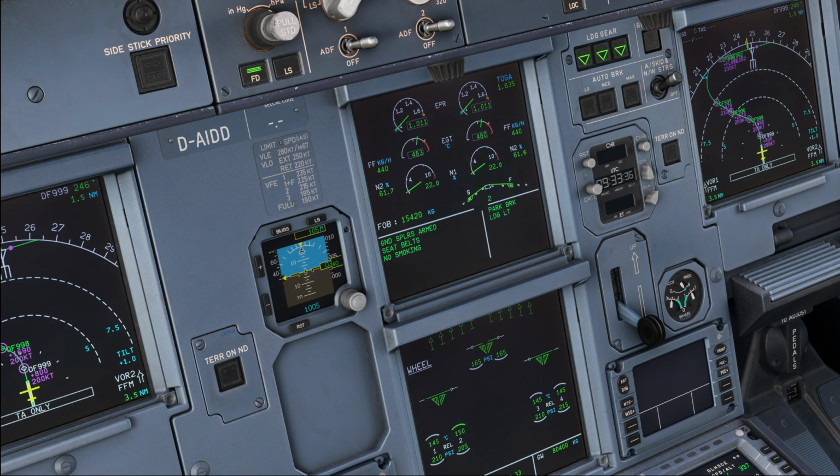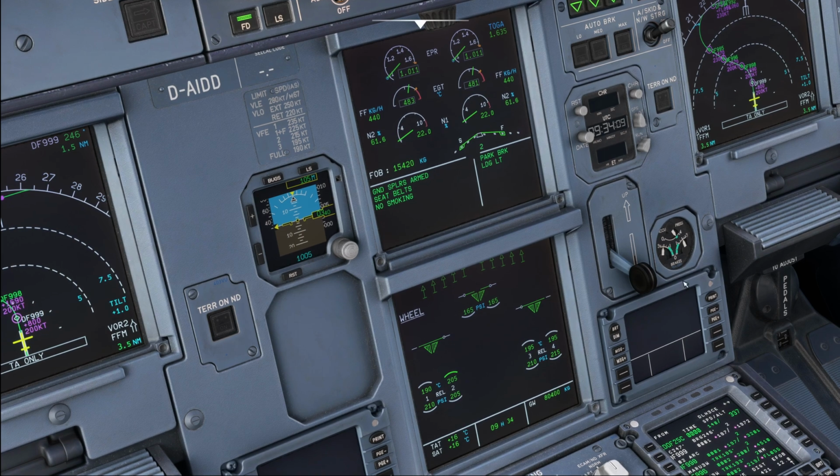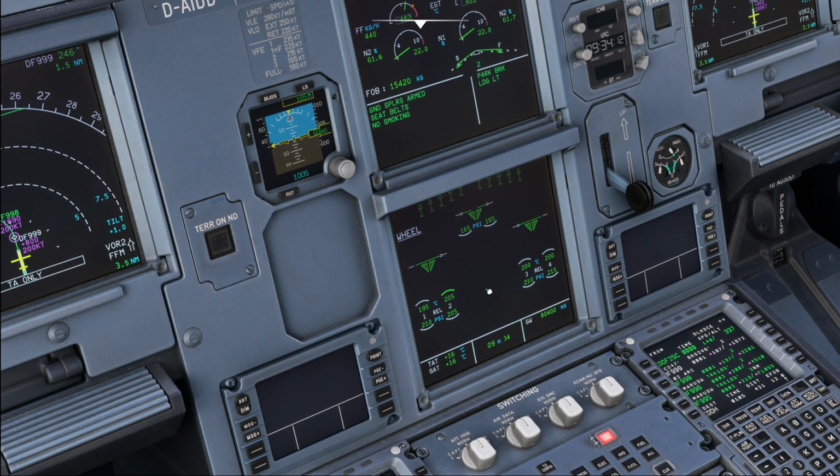Number one, the A320 family is fitted with carbon brakes. Carbon brakes become initially more effective as they heat up, but eventually they will reach a point where they become a lot less effective once they become hotter than a certain temperature. Now, when the brakes are hot and the takeoff is initiated, this temperature limit might be exceeded, and therefore your takeoff might be limited by the maximum brake temperature. And this is the reason why we've got the 300 degree limit.